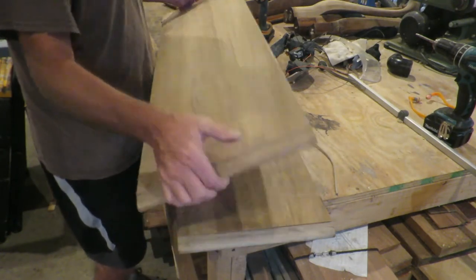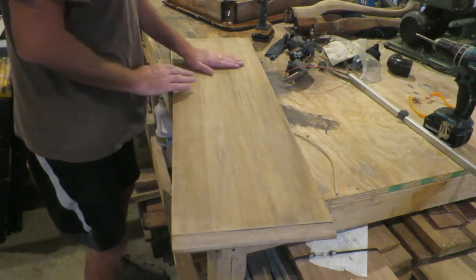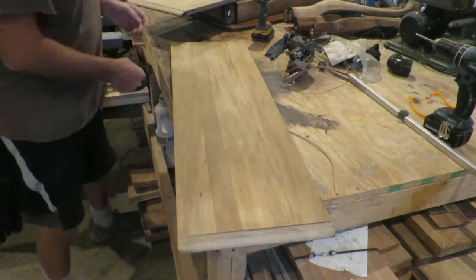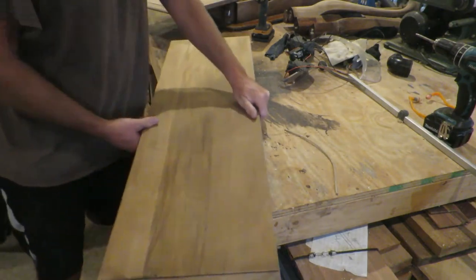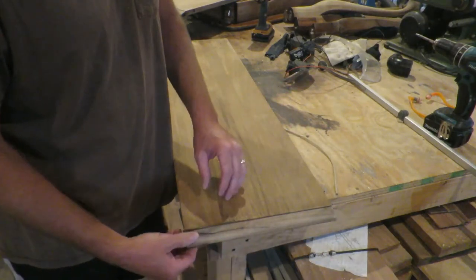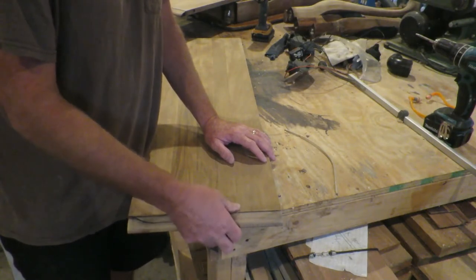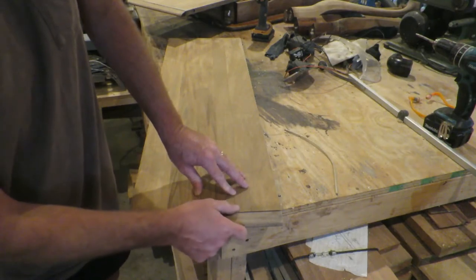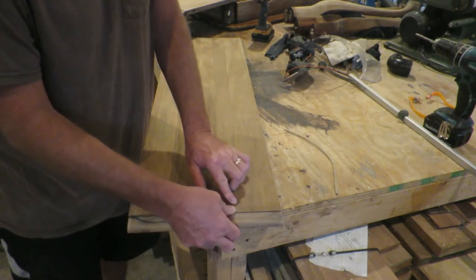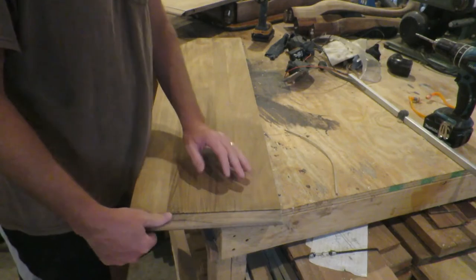When we fix this, I'm not going to strip the undersides. I'm not going to invest that much time and energy — I want to flip this fairly quickly. I don't have room to store it. The other reason they got rid of it — and the previous owner didn't think I'd want it — was because this leaf was shattered. I had this splintered vision in my mind, but it's just got a crack in here. After stripping it and using water to clean everything off, this crack showed up from swelling, which is easy enough to fix. This one's slightly offset — we'll get some glue in there once it dries and get that back the way it should be.